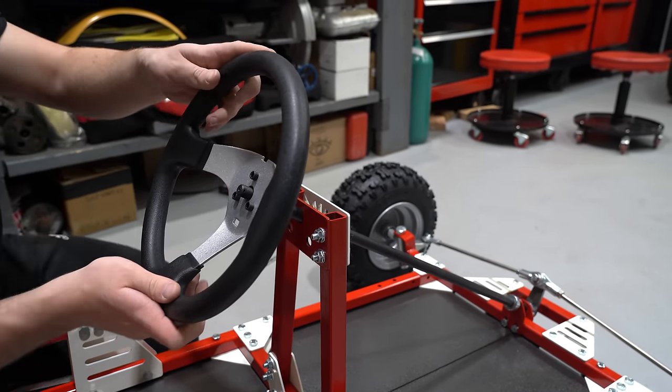Up next is our seats. If you're using the backrest, put the backrest in first and then the seat bottom. Take a marker and mark each of the holes so we can drill them. We'll be using a 7/32nds drill bit to drill these out — make sure you don't go all the way through and damage your vinyl. Then use the provided hardware to bolt in our seat with a 1/2 inch wrench. To make things look a little nicer, we're going to add these one inch pipe caps — we designed it so that you have enough space on these vertical tubes. We'll put an Amazon link to these in the description.